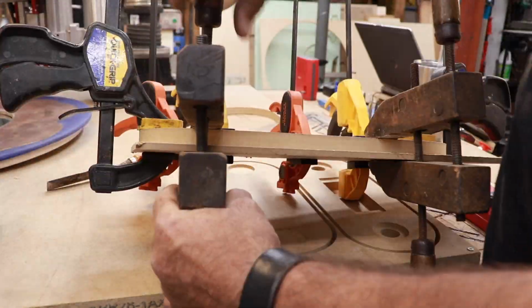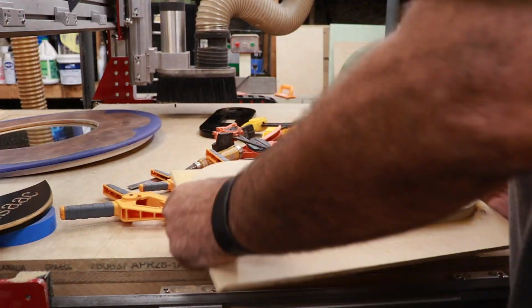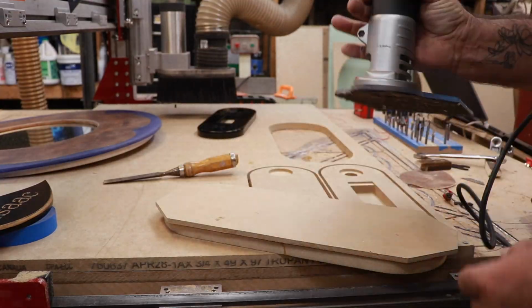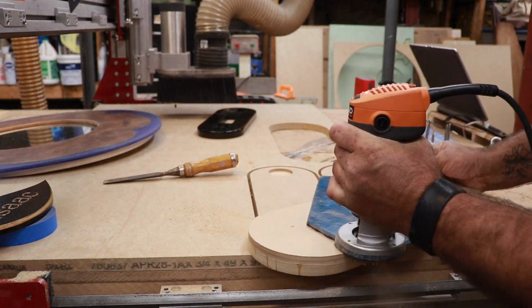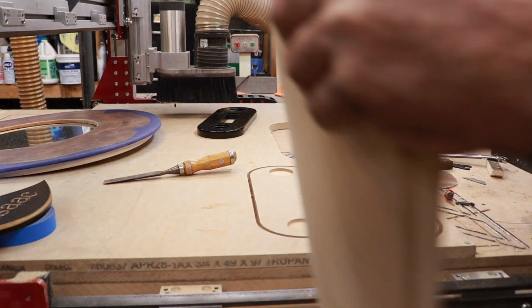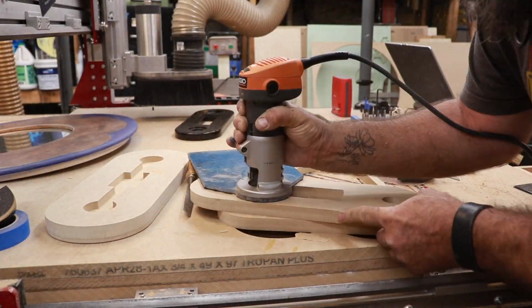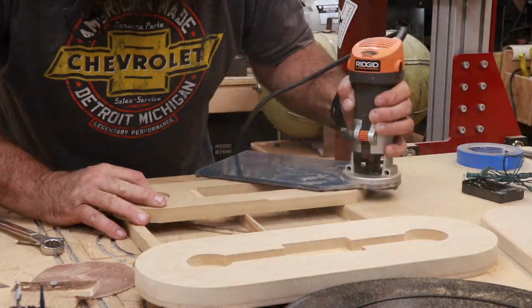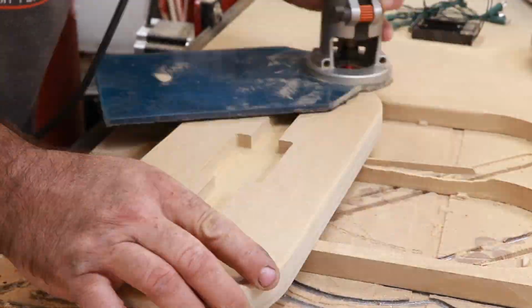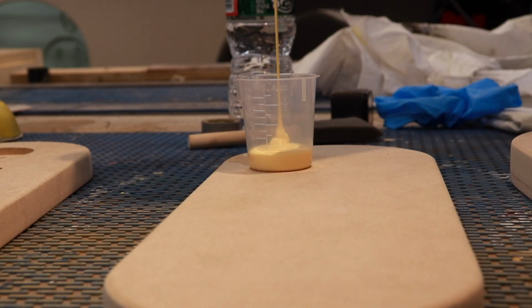I'm gluing up another piece of 1/4 inch MDF on this, and after I had this clamped up, I took a flush trimming bit and I evened it all up. And if you follow me on Instagram, this is when I had cut one of my fingertips off. It got stuck inside the router right about here when I was smoothing these edges off, and I tell you, I got lucky. It could have been a lot worse, so be careful using those small routers, wrapping your hand around it.